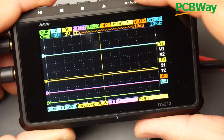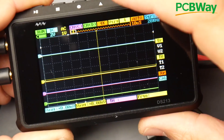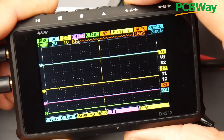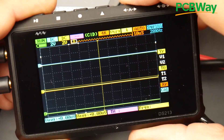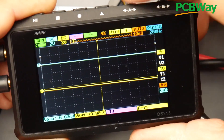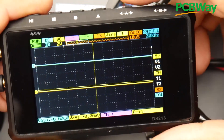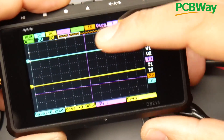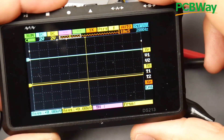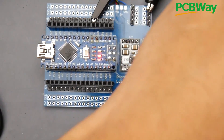First I want DC on channel one, set to 2 volts per division — meaning every square is 2 volts up. Channel two will tell us when the LED turned on, also set to 2 volts per division. I'll turn off channels three and four since we don't need them, which leaves more processing power available. Sample rate: 1K will be more than enough. For the trigger, this is very important — we want it to trigger on yellow, which is channel two. I'll set it to auto for now and leave the waveform generator aside.